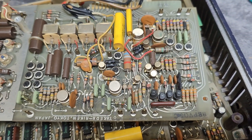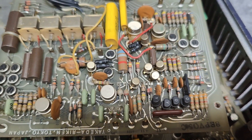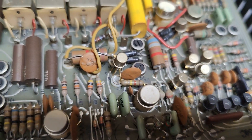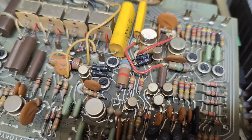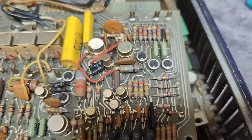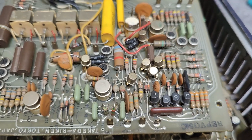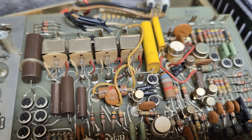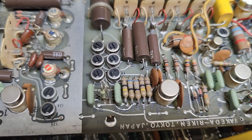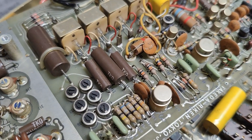This is the top board — after a little bit of cleaning and zooming in, you can see all those transistor amplifiers and all the relays, the little Teflon isolation, and all that kind of stuff. This is, of course, the high-impedance, high-voltage section with all the high-voltage dividers working as accurately as possible without any leakage. The reed relays handle different voltage ranges, and we've got some trimmers here most likely in series with the different voltage range components.